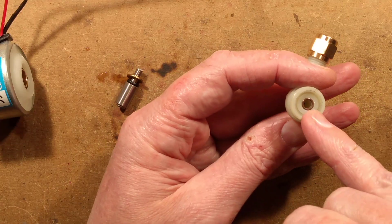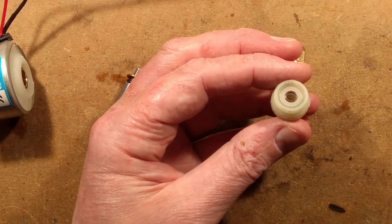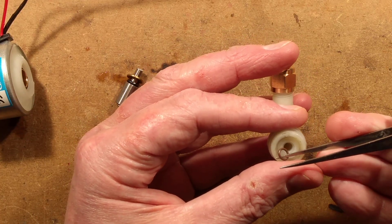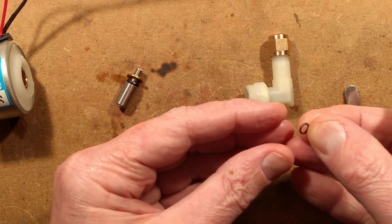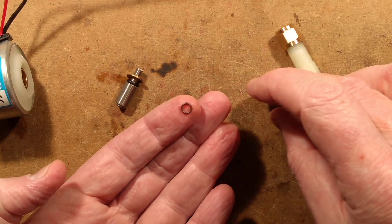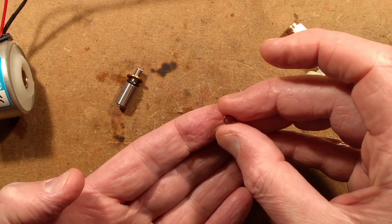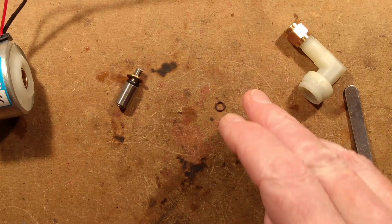And here is the big culprit. The next thing in here — I've got a pair of tweezers — is the o-ring. This is by far the biggest problem for these machines jamming up. If it's left in storage surrounded by certain liquids, it can actually puff up. I'm just going to measure it.